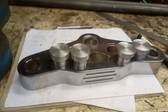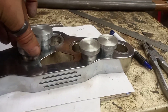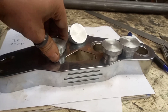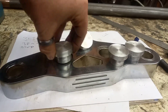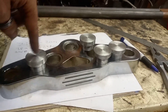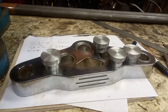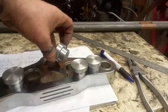So we've got the blanks all made, and as you can see these guys are a good fit - they go in there like that. What I need to do now is get them all back in the lathe and bore 12.1mm all the way through each of them. So I'll get them back set up in the chuck and get that done.